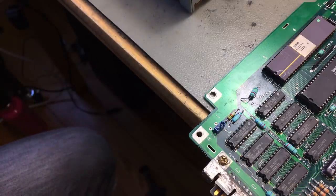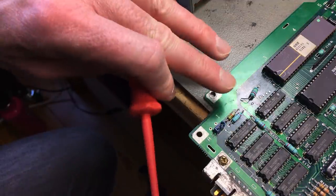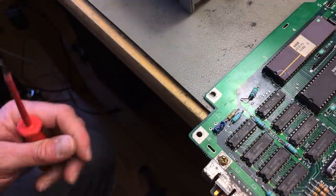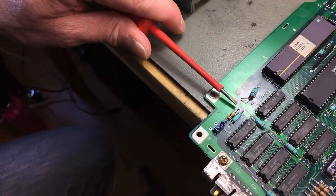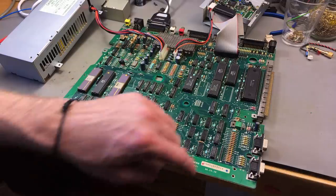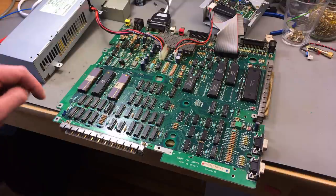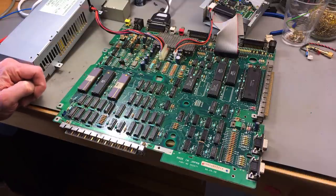There actually are quite a few spots where the soldering is not very good. And this one, you can see that the solder didn't flow all the way through. This gets into a wave soldering bath. Basically, it's bathing in melted solder. And then the wonder of physics, capillary action, sucks the solder in through the holes and onto the top layer, which it didn't in this case, and in some other cases on the board. So the first thing I'm going to do is to go over this board visually and see if I can re-solder some of the connections that haven't been soldered correctly, and of course place this little capacitor where it belongs.